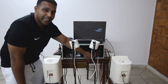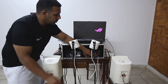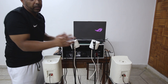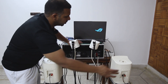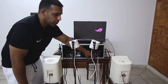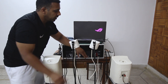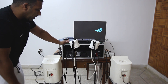The same applies to the second set of speakers. The negative cable goes to channel two's negative terminal on the amplifier, and the negative cable from the second speaker also goes to the negative terminal on channel two. Positive from this speaker goes to the positive terminal on channel two, and positive from the other speaker goes to the positive on channel two.